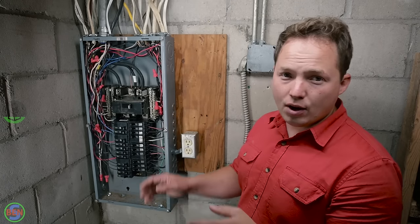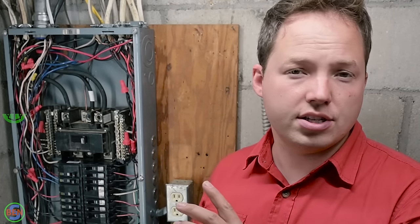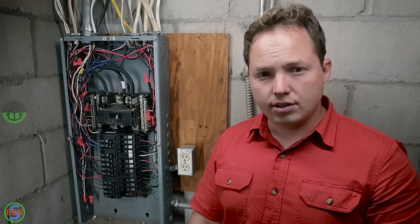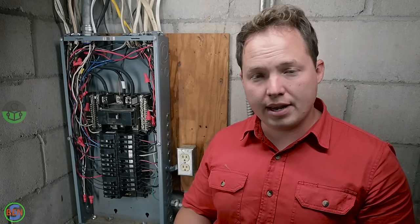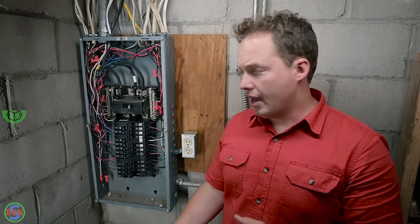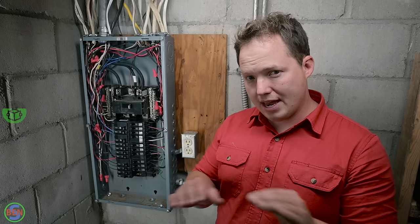You'll need to decide on what panel you're going to actually install to replace the original. Now, I'll put my top recommendations for panels in the description of this video, but suffice it to say that the bigger the better when it comes to the number of spaces. Just like I was saying earlier, this one is on the edge of being too small, even though we almost doubled the number of spaces that are in this panel. So a 40 space, 200 amp panel is probably the standard that you want to go by. I wouldn't go with anything less than that.